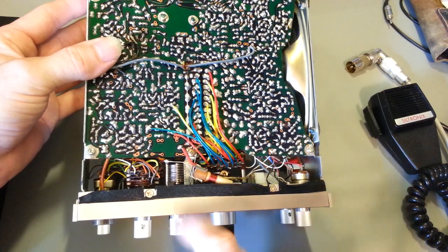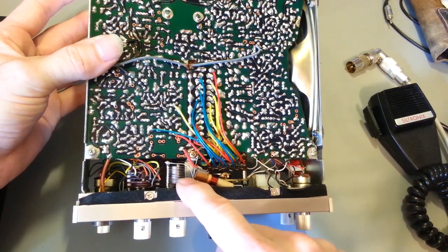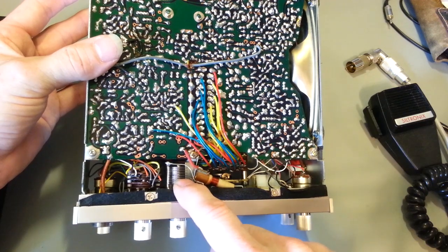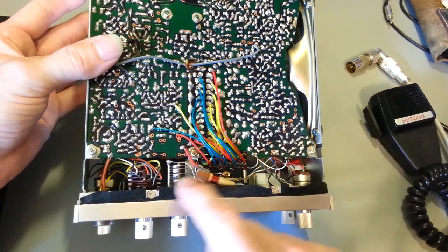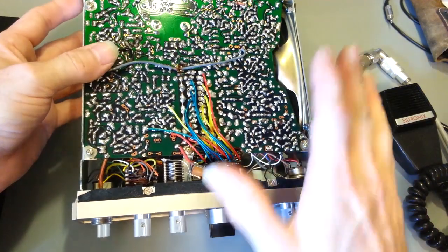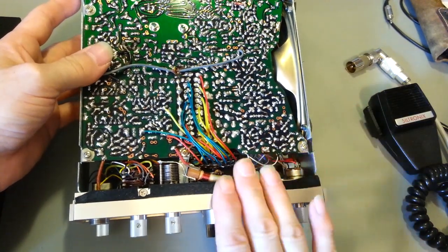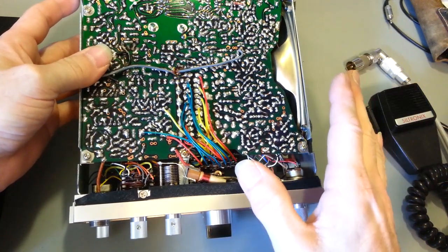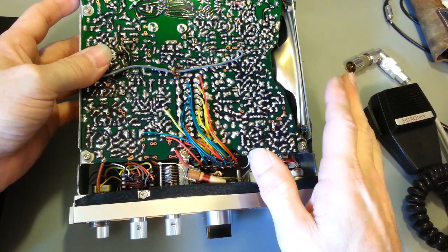It's already done, and usually your early radios, they have a delta tune clarifier. That's what you're going to find in there. It's not going to be a variable resistor, like a volume control. It's going to be an air variable cap like that. But yeah, so if you ever do work on one of these, now these are rare to start with, so odds are you won't. But if you ever do get one of these and you're doing an alignment on it,